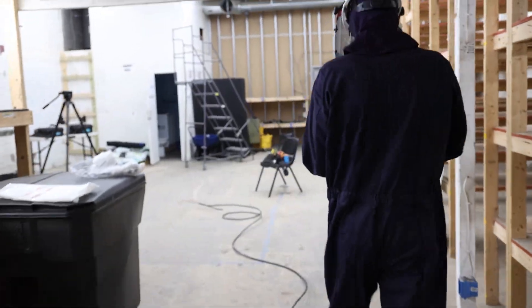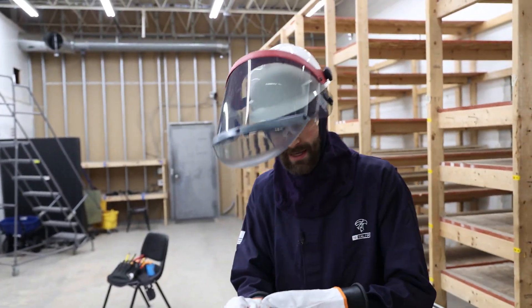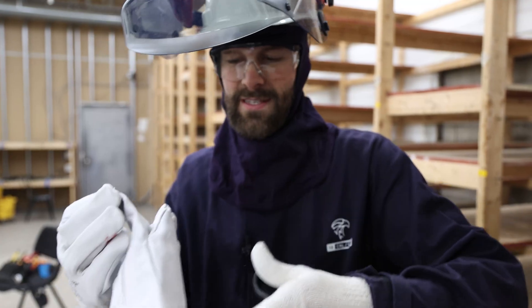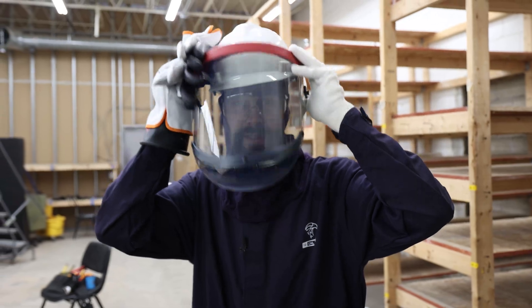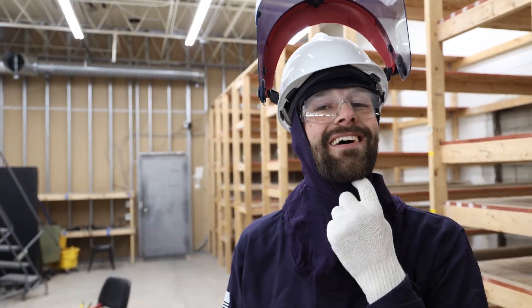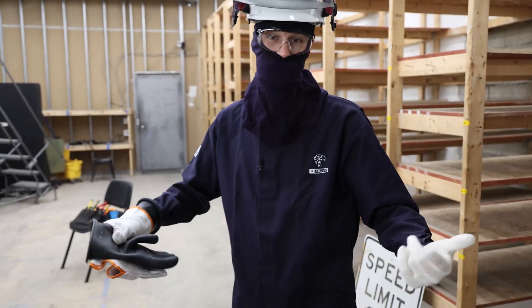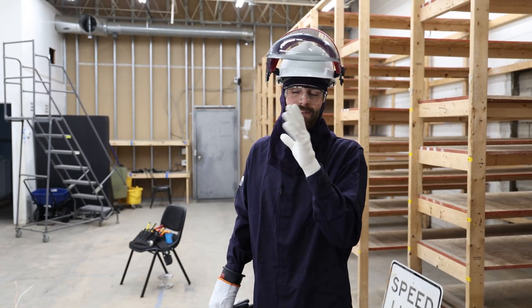Check it out. Before we get going here, let's talk about the PPE real quick. On the underside I've got sweat control, 1000 volt rubber gloves, leather overall protectors. I've got the smooth dome with the complete arc flash face shield. I've got the neck guard — it gets pulled up like this. Safety glasses with side shields, 12 cal suit. Could be wearing the boot covers. And of course, I didn't forget my dielectric beard grease. No, it's a joke.